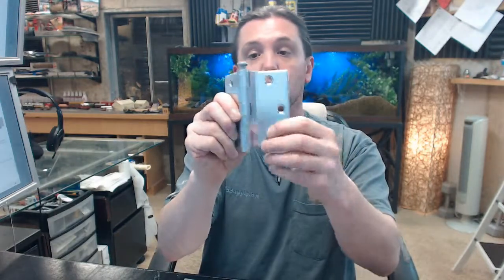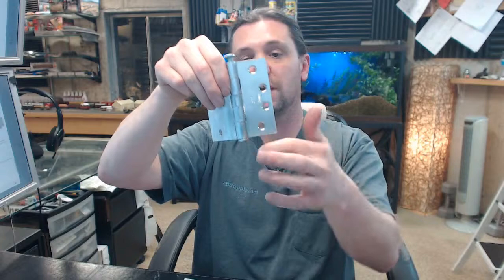The link below this video to what is called a template is very handy because it gives all of the dimensional properties of the hinge, specifically the locations of the screw holes — just called a template pattern on the frame leaf. From that template you can also see the table below, which shows how the part numbers change when the base material changes: 5300 means steel, 5301 means brass or bronze base material, 5302 means solid stainless steel, both plain bearing and ball bearing.